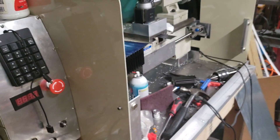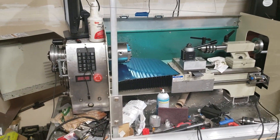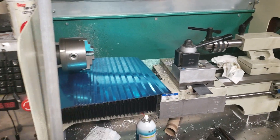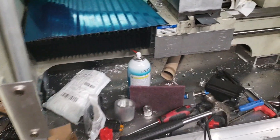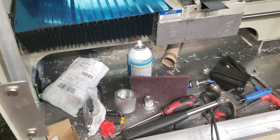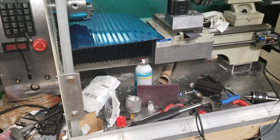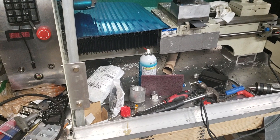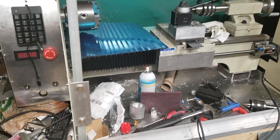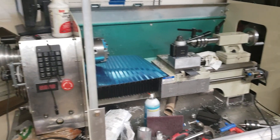The full enclosure is a bit of a mess right now but everything is coming together. Working on a cover for the lathe bed, and planning to cut the bottom of the table out to create a large chip and coolant pan with a separating screen — so the cart can be wheeled out, the screen with chips removed, coolant stays in the bottom with the pump. Should all be done within the next week.